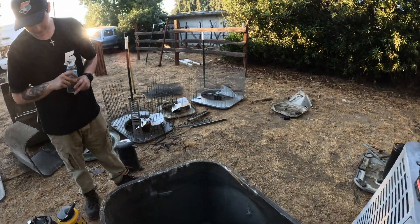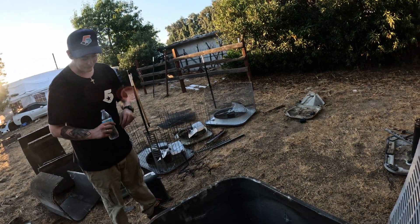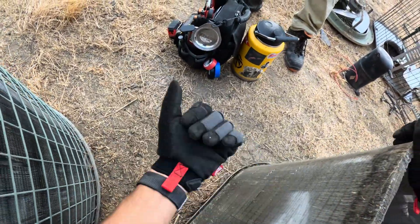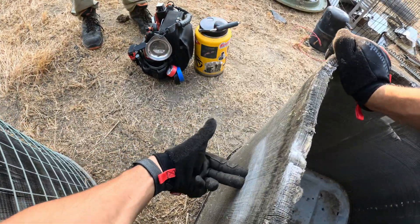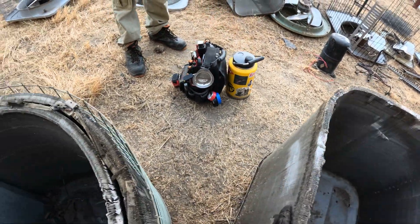There's no repairing that. I've seen videos where guys straighten out the fins — straightening them out makes the unit more efficient. When the fins are bent like this, no air is getting through that section. When you straighten out the fins, it allows more air to go through and the unit becomes more efficient.